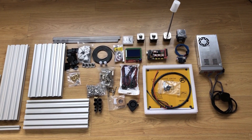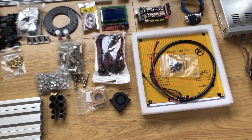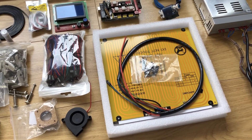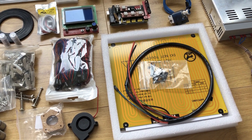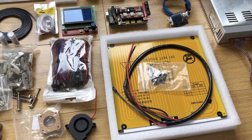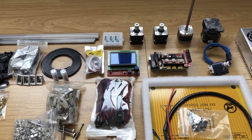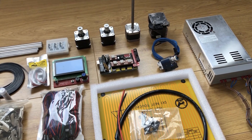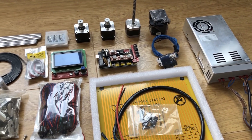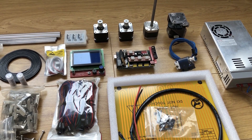Everything is pretty much carried over from my previous build. The main difference is I'm using an Anycubic Ultra Base heated bed, so I'm going to have a 220mm cube build volume, using the single Z-axis lead screw version. Everything else is pretty much standard, still running on 12 volts to reuse all the parts I had. I've got a premium RAMPS board and a genuine Arduino.